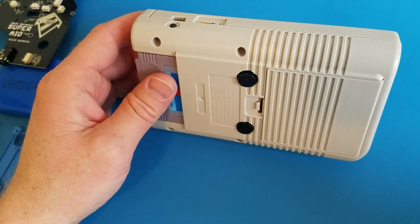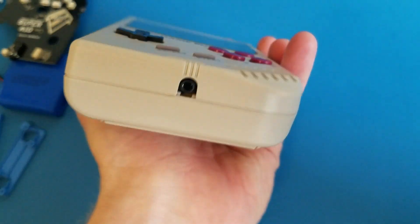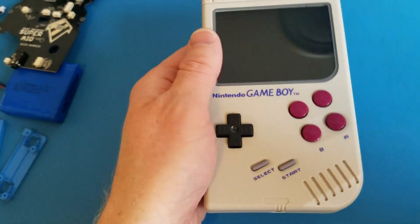And then in the original charging port right here, you have just a little tact switch. That is a kind of a shift button or a function button, and that allows the circuit board inside to do some different features. On the back, like I said, I already have the back buttons. You still have the original headphone jack, and that works. And then you also have a speaker in there — actually an original Game Boy speaker.